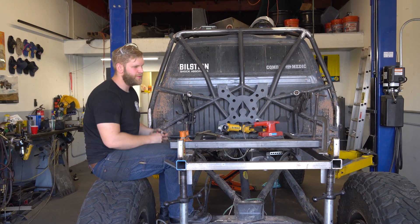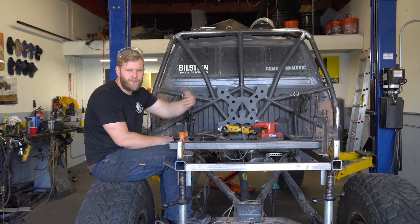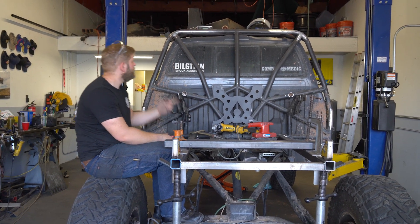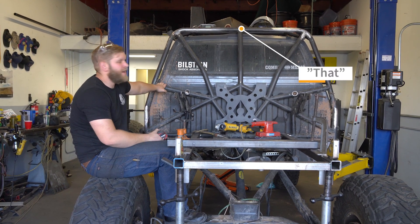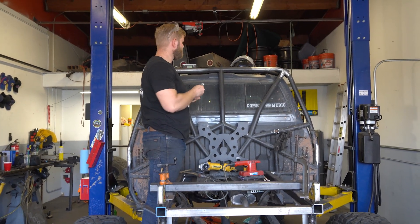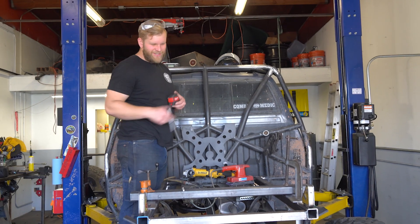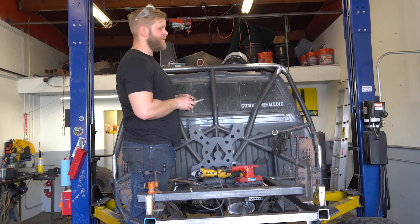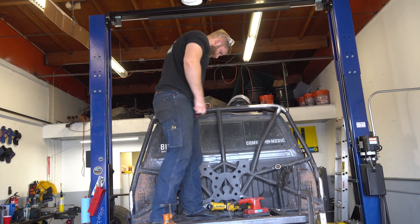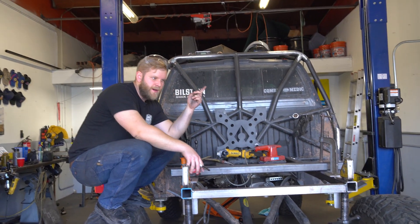This square we have here is 32 inches wide from outer edge to outer edge. We use 2-inch square tube on each side, so that's another 4 inches total — 2 inches on both sides — which means the inner dimension is 28 inches. I'm assuming I landed right in the middle, but I'll make a mark where the middle of this tube is. 28 inches, so half of that is 14 — if I measure 14 out that should be the inner edge. Now we have our inner marks for where this frame is going to go up top.